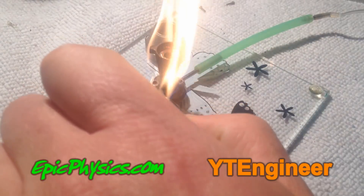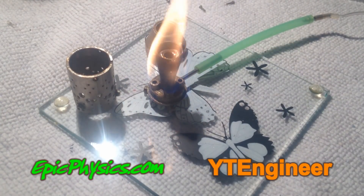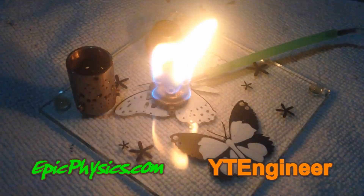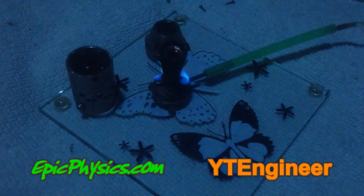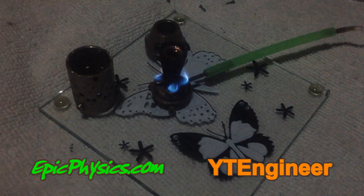I have incorporated a hollow space inside the chamber through which the fuel flows. This gets rid of the need for very small pipework which can be found in RC jet engines. Although I am using a cigarette lighter in the video, I would like to start the engine using an electronic spark ignition. I am currently doing these tests and I will upload a video in the coming days.